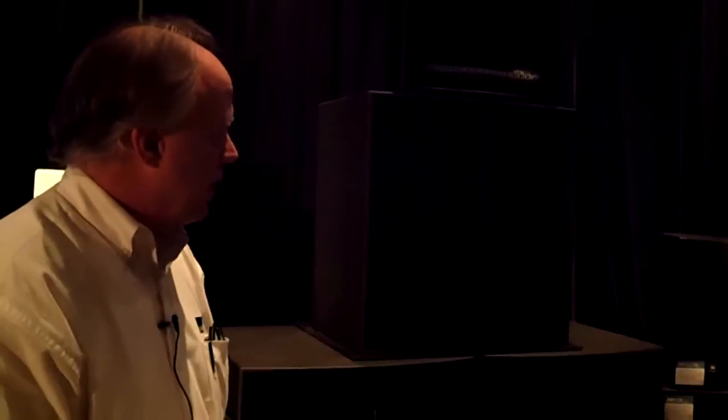We brought along our 2-way passive boxes, which are variations of the AM5212 and 5215. Basically, what we're doing there is we've reconfigured the box. We put a pole mount in the bottom, and we have handles on it, handle cups, so you can move it around. And there's a 45-degree angle off of the trap so that you can lay it down and use it as a monitor if you want a low profile. Some clubs you just can't stack them up on the side. There's no place to put them.